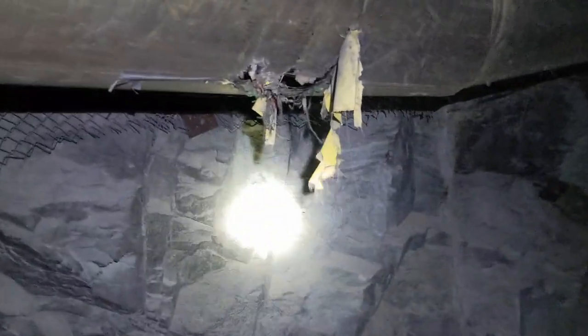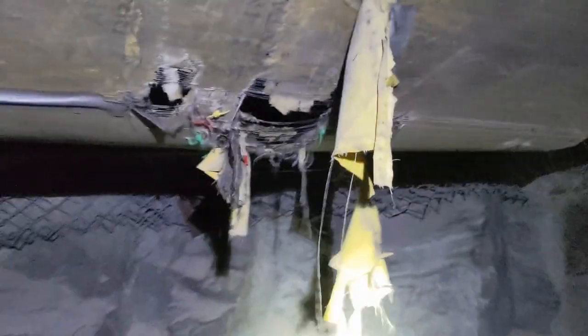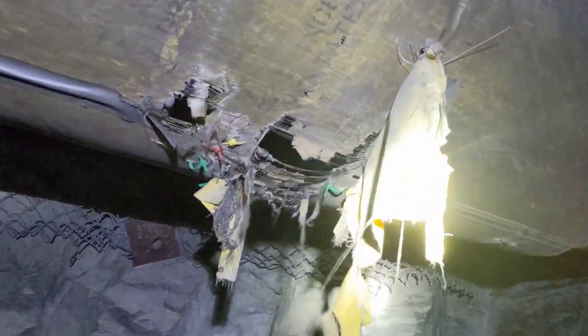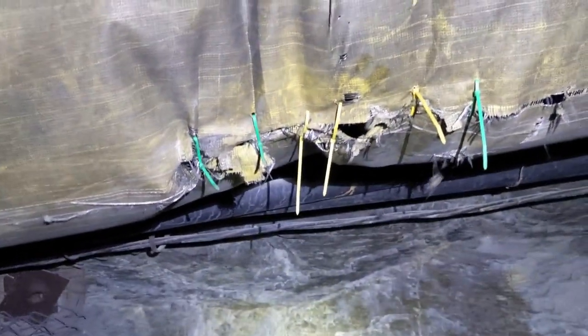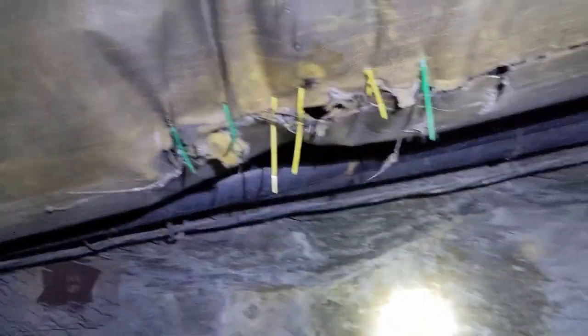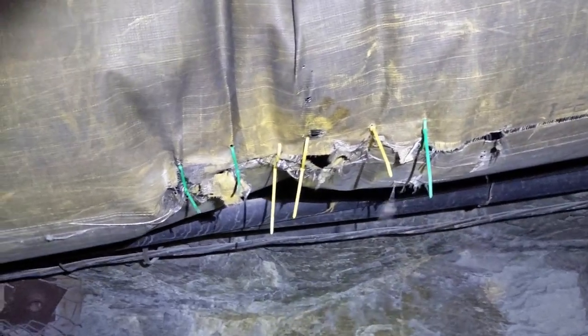Here's a previous ventilation repair. I'm going to need to be patching this. Our raincoat patch blew off and it was causing a serious bypass. This actually requires gap filling because the skin of the bag itself is kind of gone. And this one up here was actually worse. It was caused by a U-bolt on the side-by-side roof ripping it open, and it was probably splayed out almost a foot wide and bypassing probably 70% of our ventilation that was supposed to go to the face. It was coming out of here.